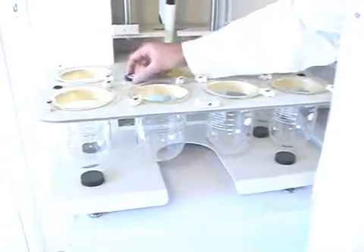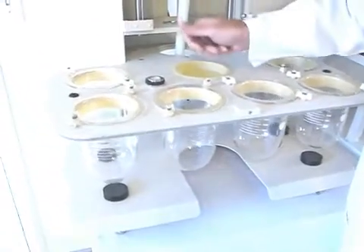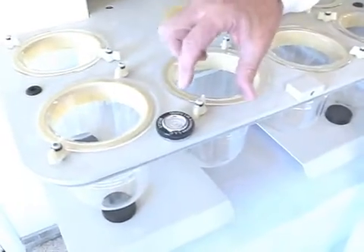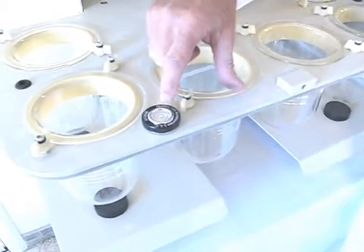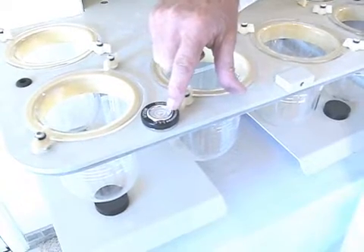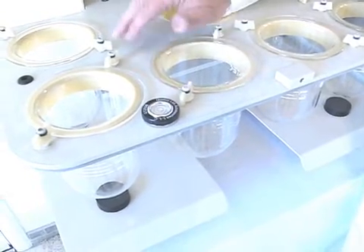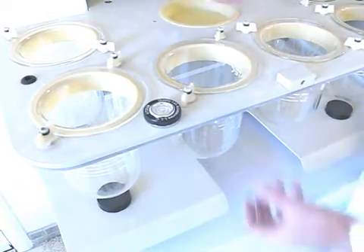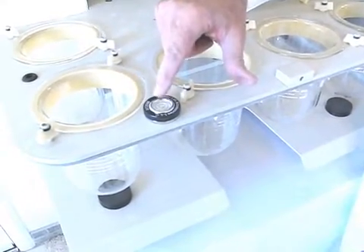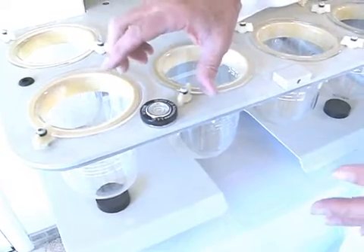Because of the circular nature, it reads both directions simultaneously. What you'll be looking at is there are two circular lines, and you can see in this case the bubble exceeds the second line — that means this vessel plate is not level enough. We would have to adjust it so that the bubble is at least within that second line, and that will ensure it's within the one degree.